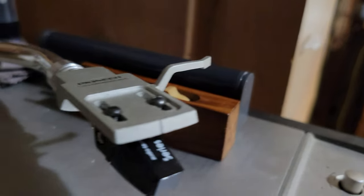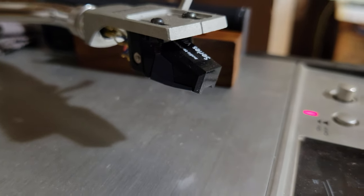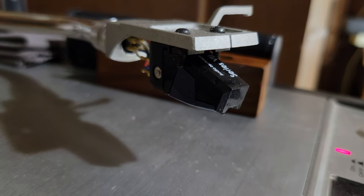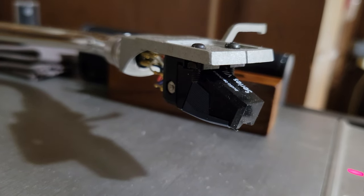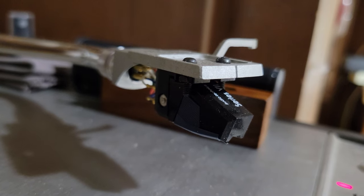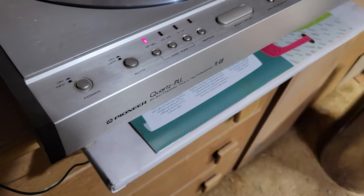Here's the old cartridge. It is an Audio-Technica Series 7, and it's not right for this tone arm really — way too massive, and high compliance I think is the right word. It's a P-mount adapted to fit on this half-inch mount head shell. It's a very nice cartridge, very nice stylus, but just not really for this particular turntable, which is my Pioneer PL630.